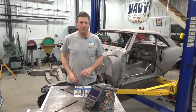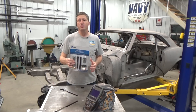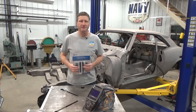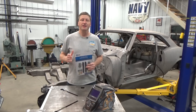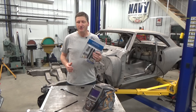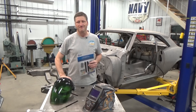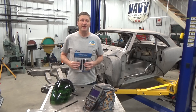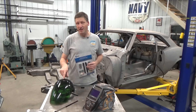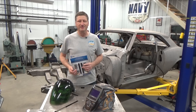This gear will definitely help you see better when welding. The helmet light accessory part number 282013 will quickly attach to any of the Miller welding helmets except for the T-94 group — they use part number 281361. And even though it doesn't say it on the package, it also works with the Miller face shields. It comes two lights to a package, and I plan on putting one light on my welding helmet and the other on my shaded face shield that I use for plasma cutting, because that's where I seem to have the most trouble seeing where my cut lines are.